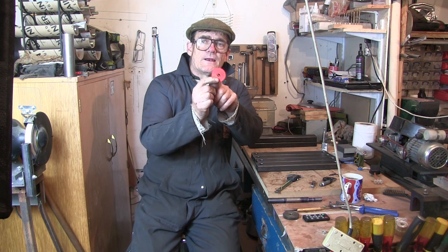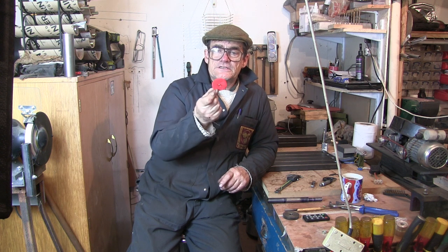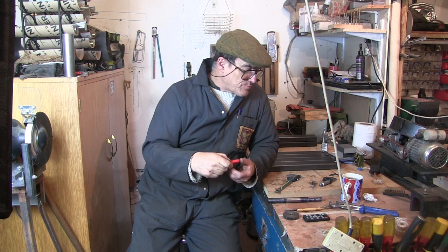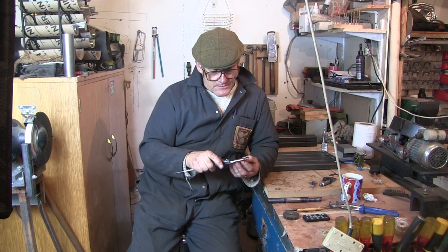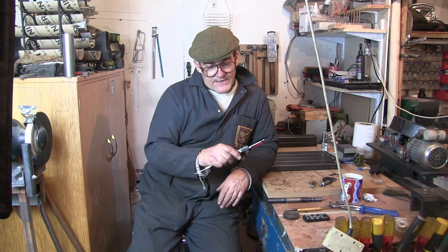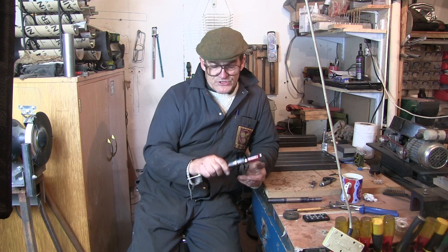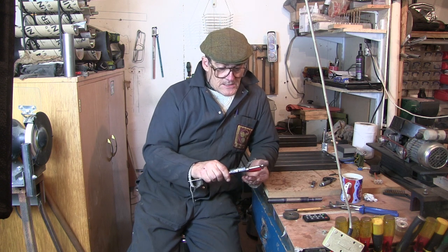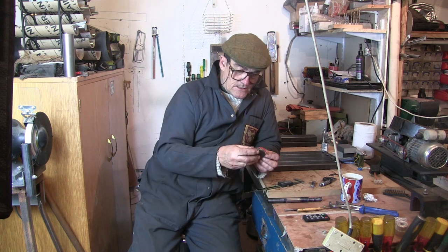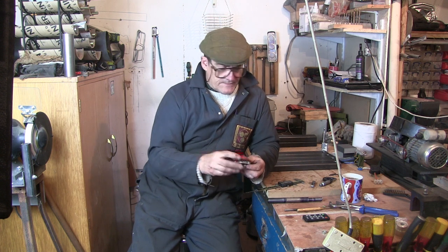And here it is. I even managed to put the 2 little pinholes in, because there's 2 little pinholes in this that locate it on the lathe, and this is it. I'm very surprised at how accurate it came out. On my calipers, it's 47.17 diameter, and I could probably squeeze them tight and make it right. But if I line it up with the gear that came off it, the teeth are absolutely spot on perfect. So stick it on the lathe and give it a go.